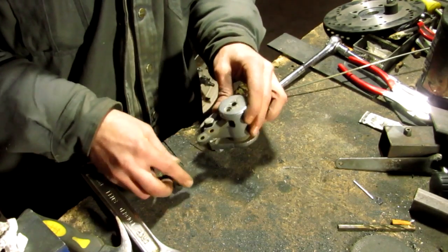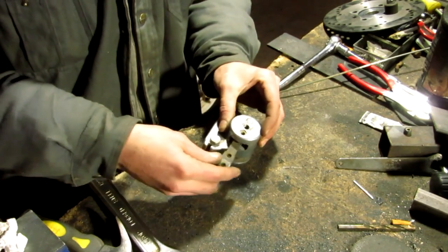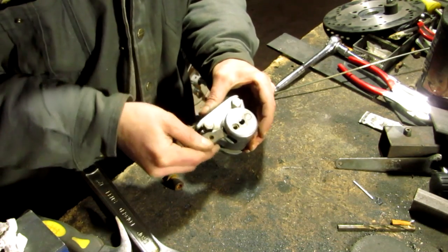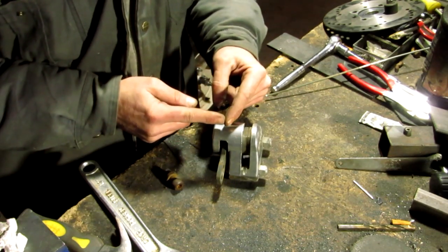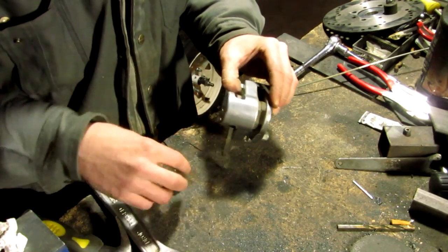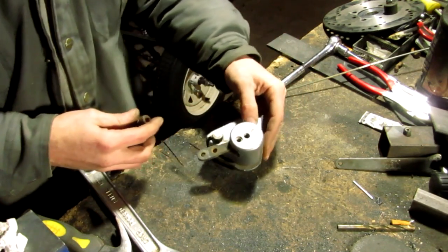This is an unadjusted one and the pads are worn down — you can buy replacement pads in a lot of places on the internet. The way this arm works is the throw — some of them have a little arrow. You can take this arm out by removing this pin, flipping it around, and putting it in so your throw goes the other way. This arm has a pointed bevel inside it, so when you pull on your rod and clevis, it spreads apart on the bolt and pin inside, which squeezes in on your pad.